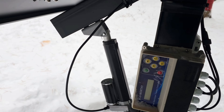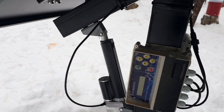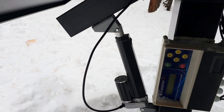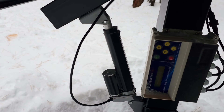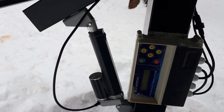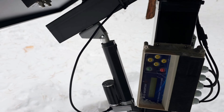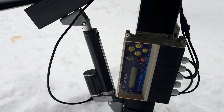Thanks to a comment left on one of my previous videos by a subscriber, here's what I think is going on with the actuator. I don't have internet up here, but I'll leave their name down in the description. Thank you so much to my subscribers for your help. What's going on, I think, is that this actuator is facing with the rod up — that's how the instructions show you to install it. But with the rod facing up, water gets down into the actuator and freezes it. So we're going to take this apart, take it inside, warm it up, dry it out, and see if we can get this function working again. Then we'll mount it upside down from the instructions and switch the wires so it still runs north and south like it's supposed to. Hopefully that'll fix the problem.